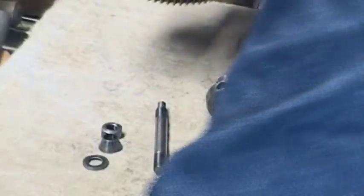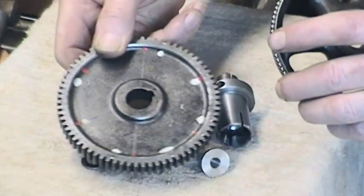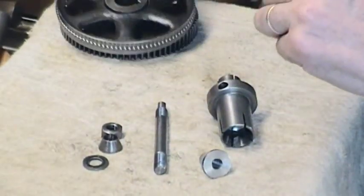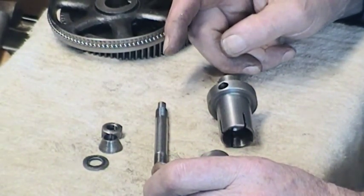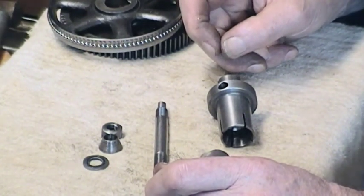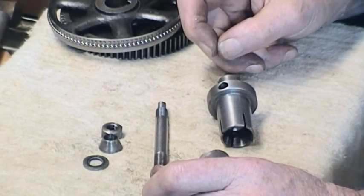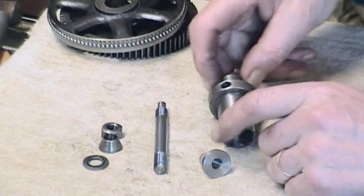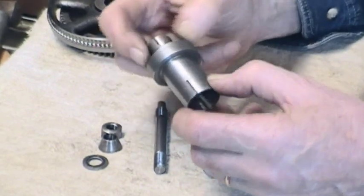...was to go with two gear wheels — I'll show you these and come to the detail in a minute. That's a gear wheel, that's another gear wheel modified. The idea was to find a way of fitting these gear wheels for division into the rear of the headstock spindle. This meant having an expanding arbor which would hold both in the spindle and then secure the gear wheel.